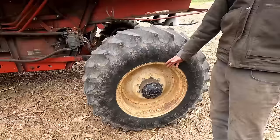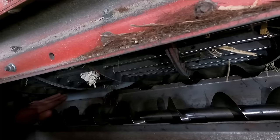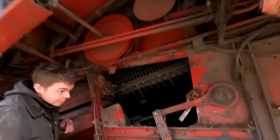This one has four-wheel drive — they called it mud hog back when you bought these. And then on the sieves, we've got three dividers across the whole sieves, so when you're on the side hill, the grain stays in each section. Otherwise you'll get corn running to one side and out the back, because you're not using the full surface area. We've also got a diverter plate in here that covers two of the augers on the other side to divert the grain more evenly. The way the rotor spins, it shells more to one side, and that really amplifies on side hills — this kind of evens that out.